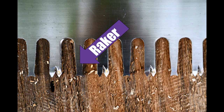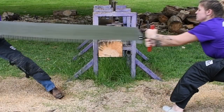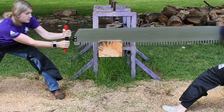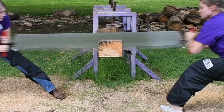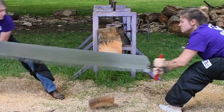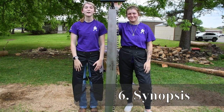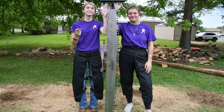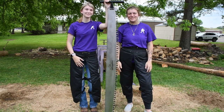The purpose of lubricating a cross-cut saw is to ensure that the teeth cut the chips, the rakers chisel them out, and they fall into the area between the raker and the tooth called the gullet. If the gullets fill with chips and those chips do not fall out when the saw exits the wood, a full gullet will not allow the saw to cut any further. If you use too much or too viscous a lubricant, it can actually cause chips to bind in the gullets — the complete opposite of what you want. The four key takeaways from this video are: practice, practice, practice, and always keep your dominant hand on the bottom. Make sure that you stay level as you drop at your waist and use the whole saw. Thank you for watching our Silvans video.